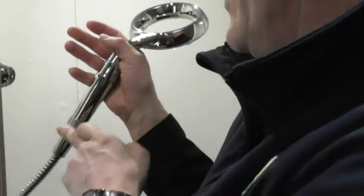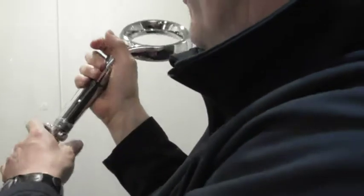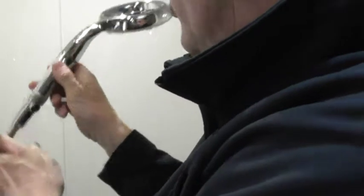We've got a little catch here for holding the door open when you're traveling. Obviously if you're on site you can just leave it open. That sliding catch locks it just for traveling. Nothing too complicated in here — mix tap, head for the shower, the tap's got an on/off button there. Obviously for winter make sure that is all drained down — don't let any water be held in there. It's best to take that off, make sure it is open, and then drain it all down.